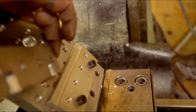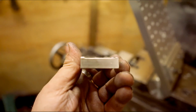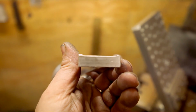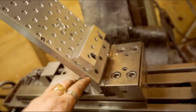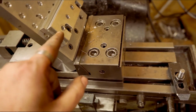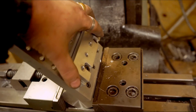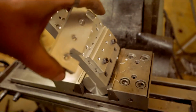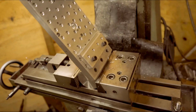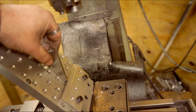And then you'll put your strip of brass or steel in there, and that's recessed, look, recessed in the middle. So when you clamp it down, it's only putting pressure on, well, basically that stops and that puts the pressure on that toe gib. Now these, if you do decide to do it this way, they have to be indicated in both axes and also indicated that way.